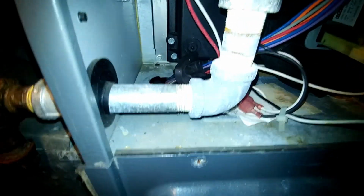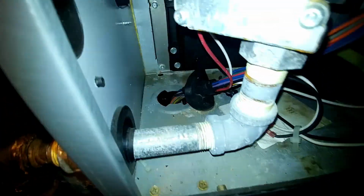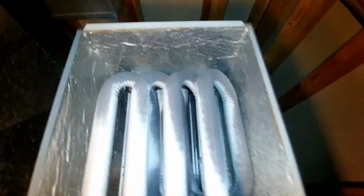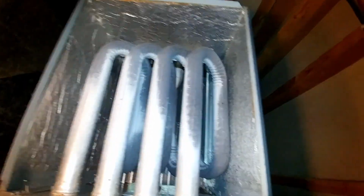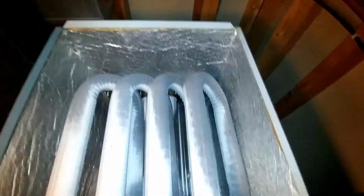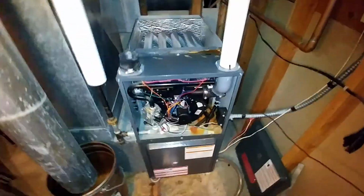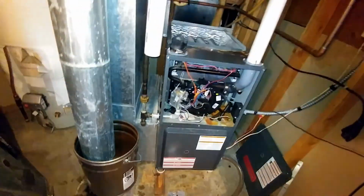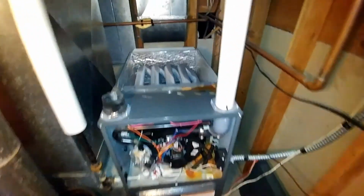Well, the only place it could come from is outside because it's a sealed burner box, but that plug needs to get put back in there. This furnace obviously didn't have any temperature rises being done or checked on it, because I've never seen a tubular Goodman that scorched. It's not even that old of a furnace. This should have been a 60,000 for sure. It's running way too hot. And static pressure's probably off the charts with that filter that's too small and that pleated filter in there.